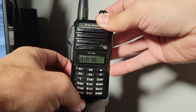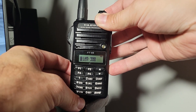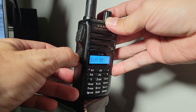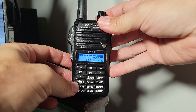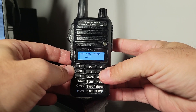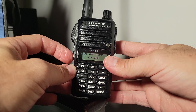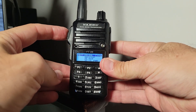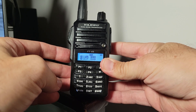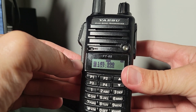Now the other aspect of this for the space station is we must have the CTCSS tone of 67. So we want to configure that while we are here looking at the B channel. We're going to go to our menu by holding down the function button, go up to item number 29, select squelch type, and set it to transmit tone, which is indicated by T-tone. A tap on the function button returns to the main menu, and then push-to-talk returns us without transmission to the VFO screen.